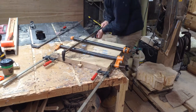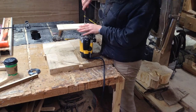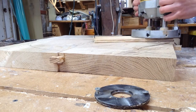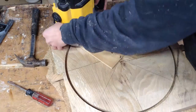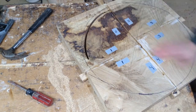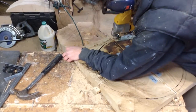Next I had to cut out the top. A lot of the dimensions I used are based on measurements I took off of existing chairs. I believe this ended up being about a 17-inch diameter. My circle-cutting jig is a basic piece of plywood that bolts to the bottom of my router and works just like a compass on a central pivot — you set the radius. I ended up with a quarter-inch straight-cutting bit, but since this is a pretty thick slab I couldn't get all the way to the bottom, so I cleaned it up with a jigsaw. There was only about an eighth of an inch left, so I went through that pretty quickly and then I had my circle.